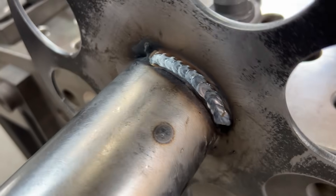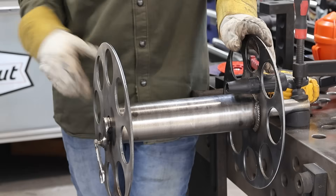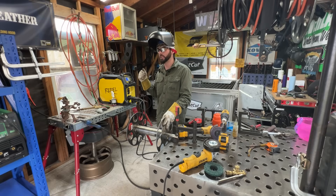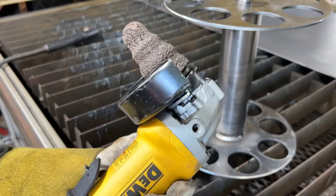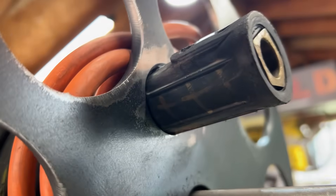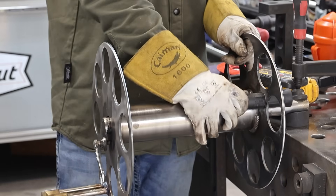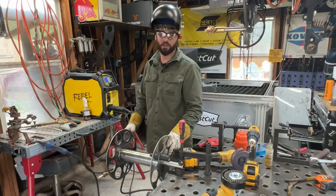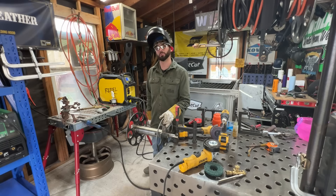Now the main body's done. The welds look good, and after getting them cleaned up they look even better. As far as the accessory portions, it's just a lot of little bits and pieces. We're going to take everything over to the plasma table again and swap out the CNC cutter with the hand torch. I went ahead and cut the hole for my LC-40 connector — this hole just needs to be just big enough that I can hammer the LC-40 in. It's not technical — it's pretty crude. However, it does keep it in place easily, and I don't have to worry about a live line. I will only be able to reel this with it unplugged, so that's the biggest drawback — but it's a lot cheaper.